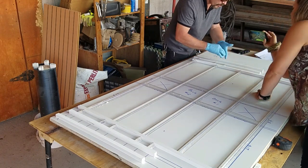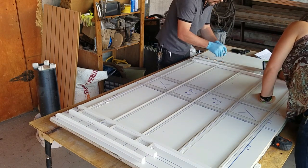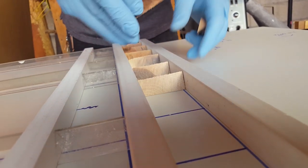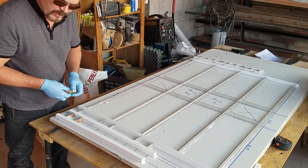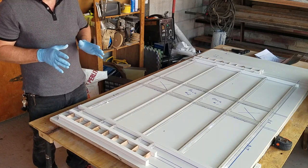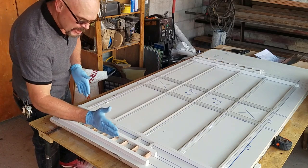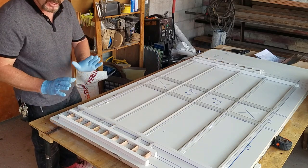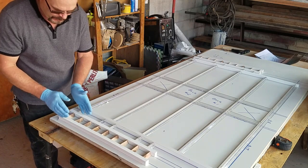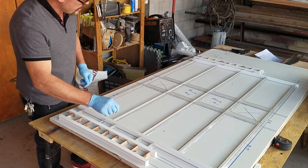Now for the riser, I'm putting in the 45 degree wedges made out of the same material, this corner molding. Now here I am setting in place the 22.5 degree wedges where they're gonna go. At this point, I'm just explaining to Mrs. Honeydew how I want to hot glue gun down the end form pieces that are set around the V wedges, then pull the V wedges out and mark lines across the top of them so that we can precisely set those V wedges in place to complete the form. After you tack down that first piece, everything else just gets pushed up against it.